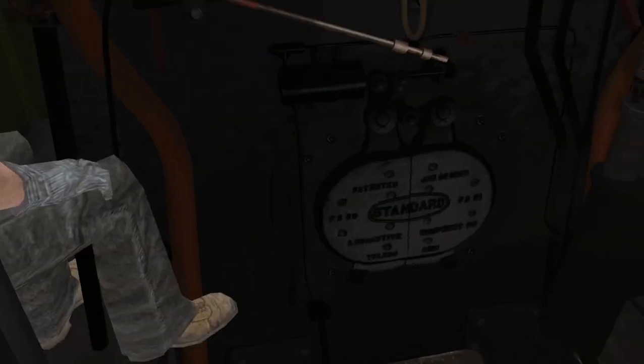It's a tallow-based grease, so it doesn't break down, or oil. It's almost a grease, basically. It's really, really thick stuff. And usually there'd be a hot shelf or something in here, and you'd have a tallow pot on it and an oiler. That would be something you have to do periodically throughout the day, is top off everything.